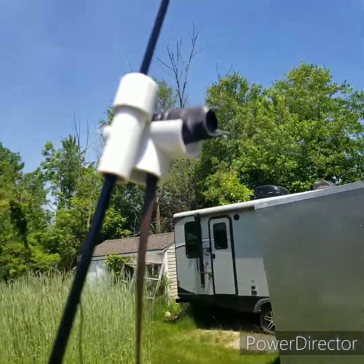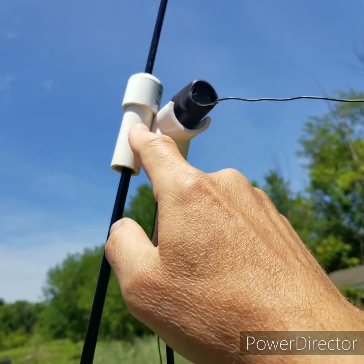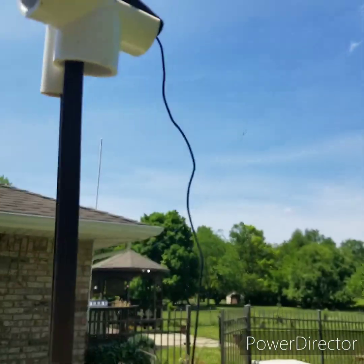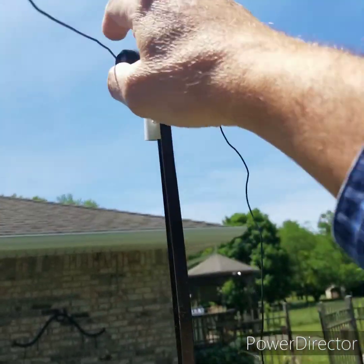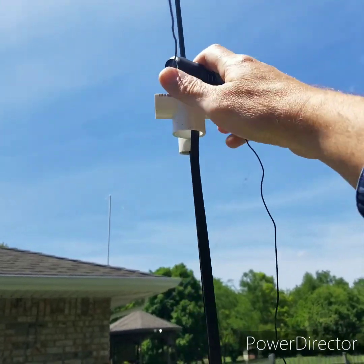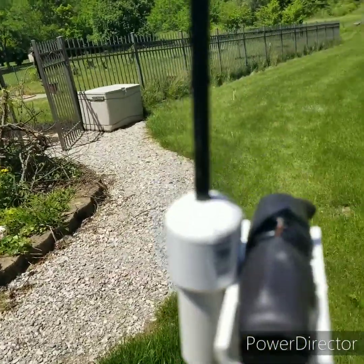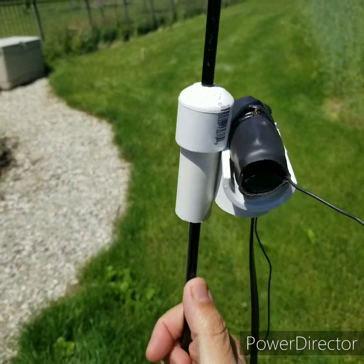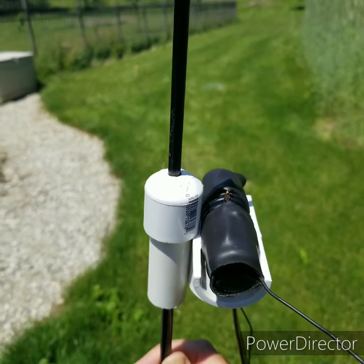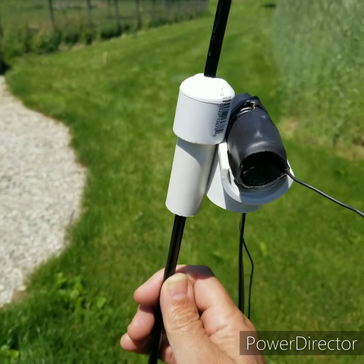The center of the antenna is held up by a piece of T-PVC, superglued to a small piece of PVC with a cap superglued to it. The TV twin lead goes right through the center of this T-junction PVC, and the antenna center just sits in the little holder. I have a hole in the top of the cap that allows the top three feet of the antenna pole to go through it, but sections beyond that are too big in diameter. So it holds it in place. With a 20-foot pole, I end up about 16 to 17 feet up in the air.